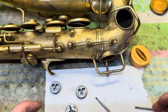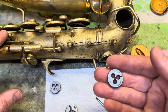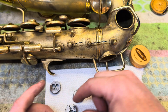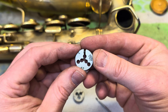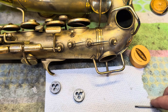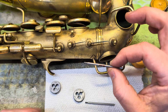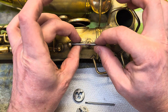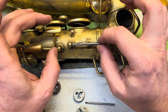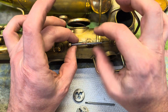The headless pivot screws on Conns are 4-48. To clarify: 4-48 is the pivot screws for Conns; 3-48 is the rods and pivot screws for Kings and also the rods for Conns. We just saw the looseness of a 3-48 UNC. Here is a 3-48 NC that I just made with this die — already feels a lot better screwing it in. When we screw this all the way in, it is super firm, nice, and feels like the original.